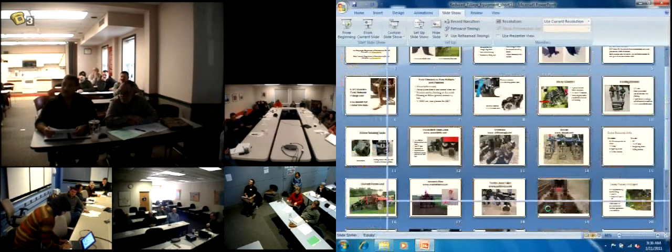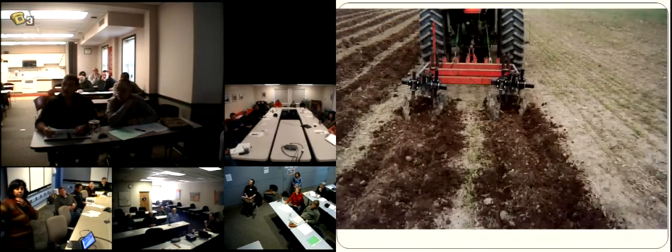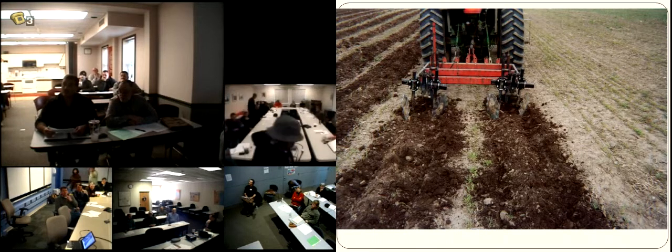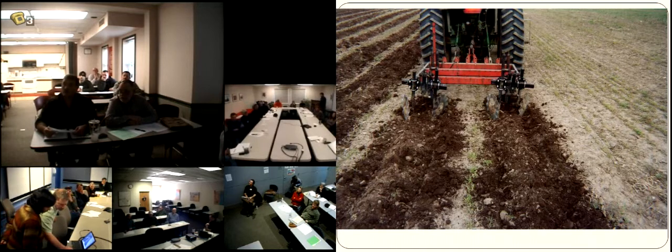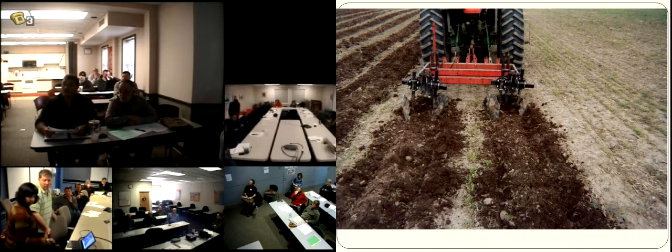I do that about the first week in April or the last week in March, as soon as I can get in the field to get it ready so I can plant my strawberries in April. All it is is two chisel shanks and then two sets of closing covering coulters on the back to shape up a ridge. I pull it about 13 or 14 inches deep with a 30-horsepower tractor. There's no fancy equipment on it. The only thing different if I had a heavy cover crop ahead of time, I'd need a coulter in front to cut through, and there's a toolbar I made so I could put one on, but I've never needed it.